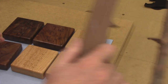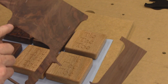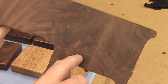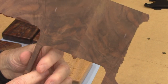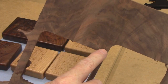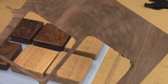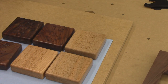As far as the burl, especially for burls, look for defects. And I knew this had defects. You may be able to see it right here. There's a crack there and a crack there. They're bookmatch cracks. But you can also see that they transmit through, at least this one does, on the opposite side. I should have filled those and repaired those defects before I milled the box.